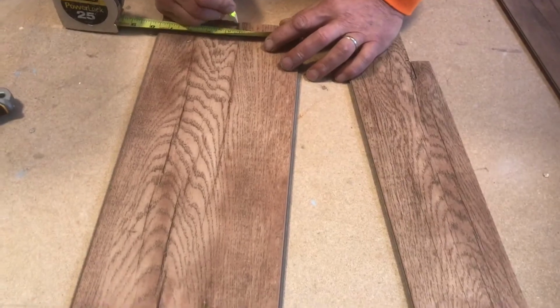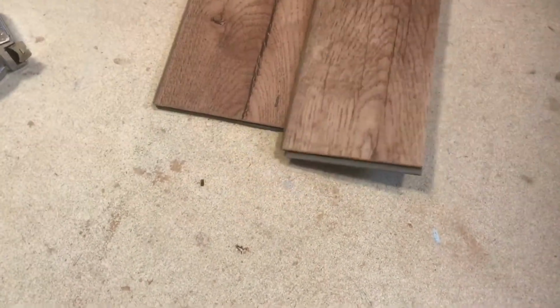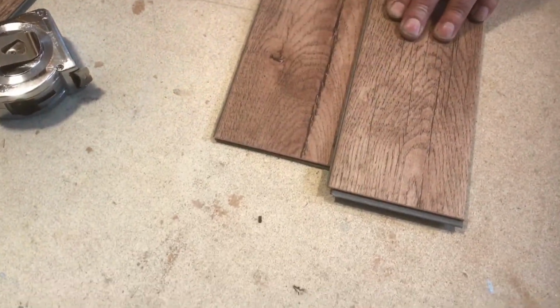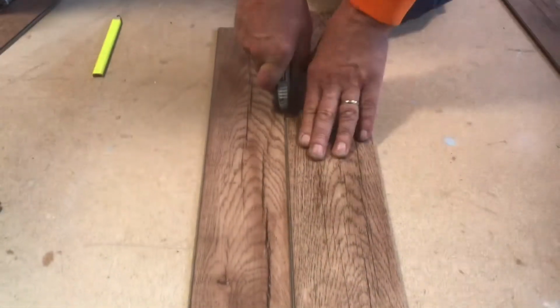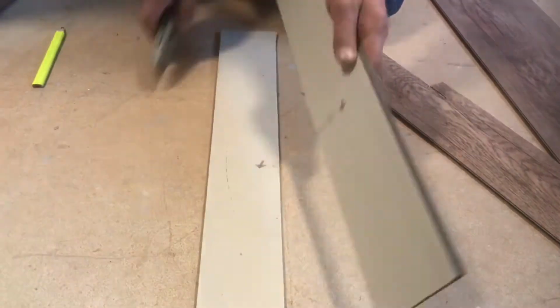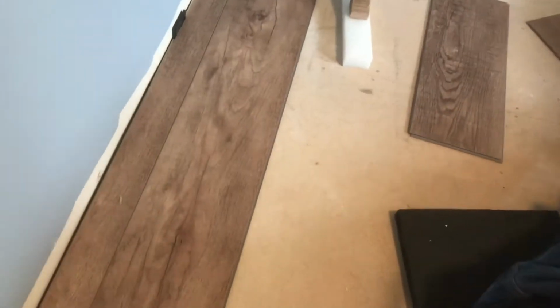We're good. Okay, and then we're laying that first row along the wall all the way down. And I think we're going to go ahead and lay one first solid row. We'll have all of our spacers put back there. We're just going to run the whole first full row in reverse direction. So you see we're putting the very last piece down there on the end.